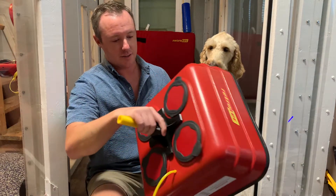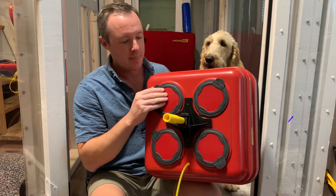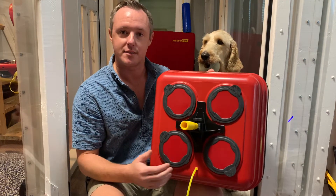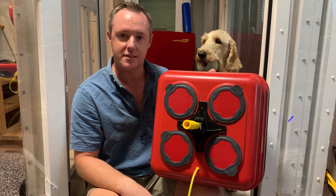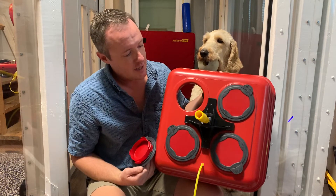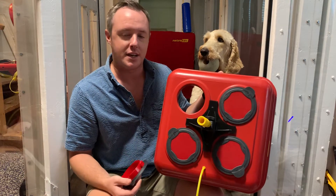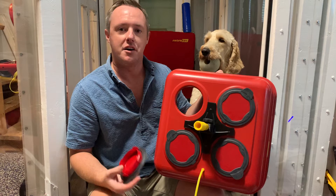That's what this is here. You can see that there are four holes on it — it has the same range plugs as our blower door. With all the holes plugged up, it works as a pressure pan to go around and find leaks in a building enclosure. But if we take out some of the holes, it works as an exhaust fan flow meter. So we can read air flows anywhere where there's an exhaust under 200 CFM — great for measuring bath fans, some kitchen exhaust, whole house ventilation, and some room returns.